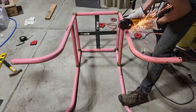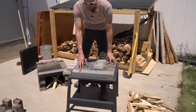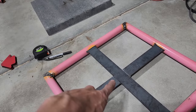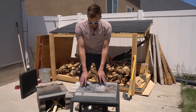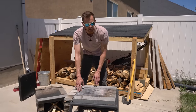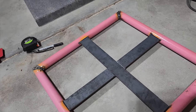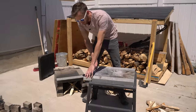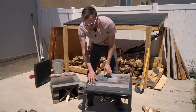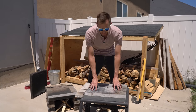This is the steel frame I built to hold my pizza oven. It's specially designed to have one of these paver stones at the bottom of it in a nice secured frame, and then there are more support struts underneath — one going this way and one going this way. You can see that after just a couple of firings this stone has started to crack, but it's not started to move at all because it's supported so well on all four sides and underneath. I've got these two smaller pieces off to the side — made from a thinner paver stone — just to make sure they balance out to the same height. And now I'm going to build that exact same pizza oven up on top of this.